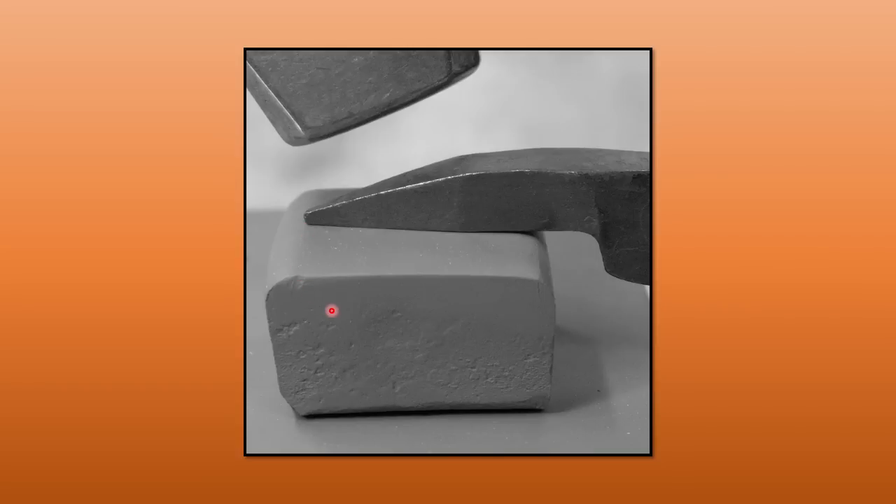You'll notice I'm working on an anvil block so I can keep the shoulder of the tongs down without hitting it with the hammer, while still having clearance for a mis-hit. If I work in the middle of the anvil face I risk putting a smiley face in the anvil surface — not something I want to do. Also note I'm not taking the taper down to super sharp; I'm taking it down to about 1.5mm or one-sixteenth of an inch in square cross-section.